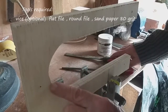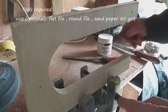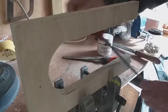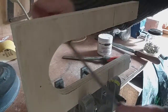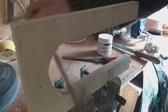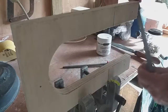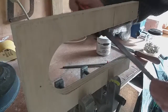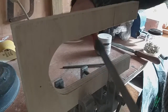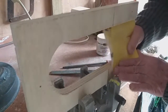The other thing I'll be doing is rounding this edge here, because the leather will be bent around that corner. For that I'll take a round file and just take that off. I want a nice rounded edge there. Having done that, I'll then work it with a bit of sandpaper, just to get it all nice and smooth.